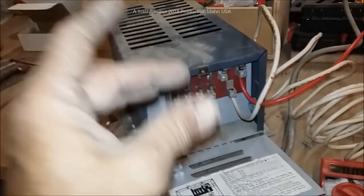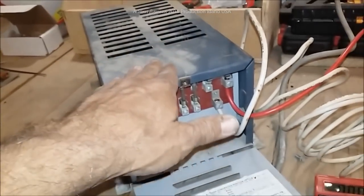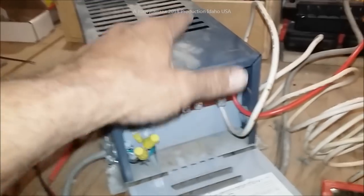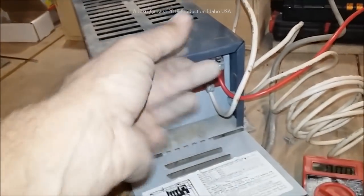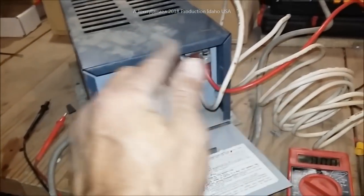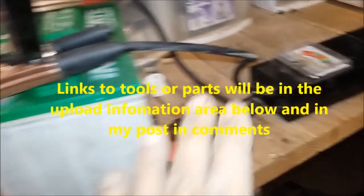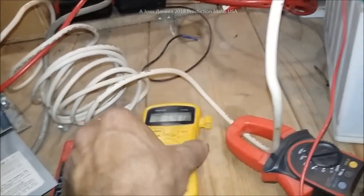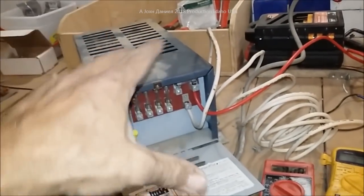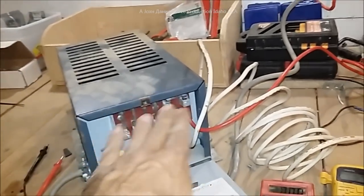Replacing the rectifier in these is pretty straightforward. The rectifier is a little cube rectifier — if the plastic is separated from its metal casing, it's bad, pretty obvious. Or if you smell something like hair burning, that is the smell of the rectifier failing. Disconnect it, take it out, and get the number off the rectifier from the heat sink — the numbers are stamped on them. You can order it through Amazon. I'll put the link for this meter and for the rectifier, and you've seen how to test and verify what you've got.